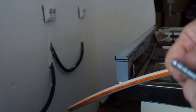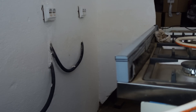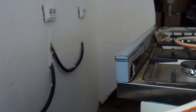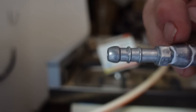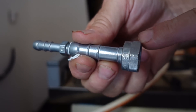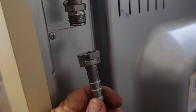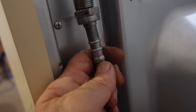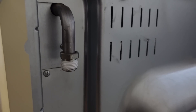I'm just going to screw this little adapter into the pipe, tighten it up, position it on the cooker, and run the pipe towards the gas bottle with a new regulator - so we should be all good. I've put some PTFE tape into this joint and tightened it finger tight, but I need to go and get tools to tighten it fully. I need a bigger spanner to tighten it onto the cooker. So now I'm fitting the adapter onto the bottom of the cooker with PTFE tape and putting the hose on - all wrapped with PTFE and the connector on.